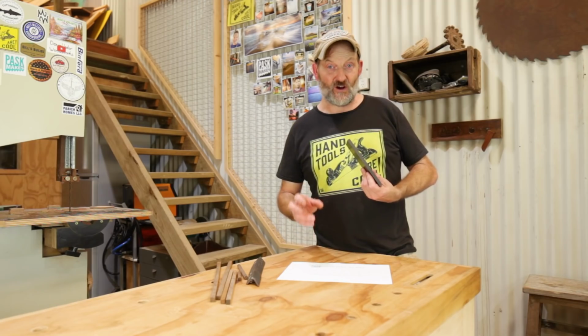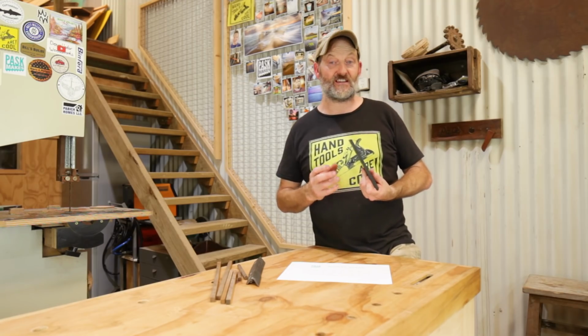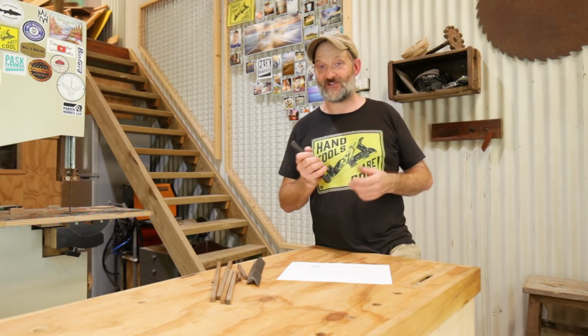I'm making the series of holes go down in half mil increments, and the reason for that is I'll be able to take one final pass and just take off half a mil, and that should leave a nice clean finish. So that's what I'm hoping. We'll see how that turns out.